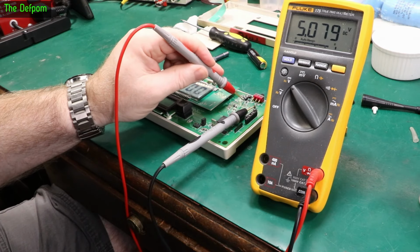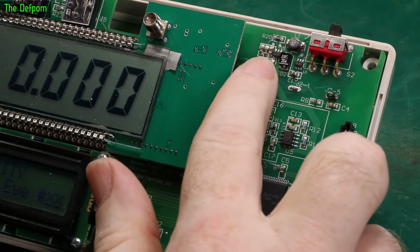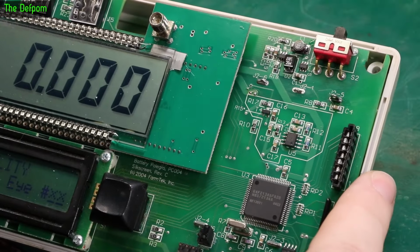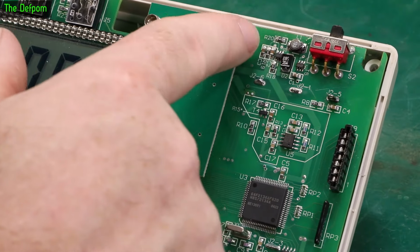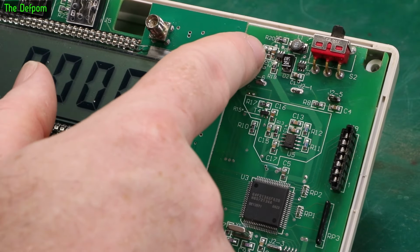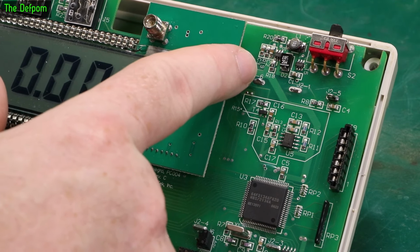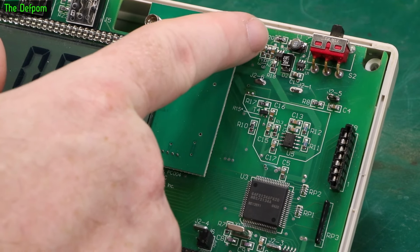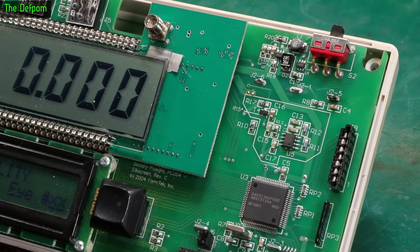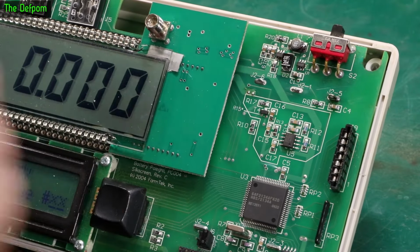Yep, look at that. So this regulator circuit up here, I should actually explain a bit more about what this chip actually is. It's a 1.2 megahertz, 600 milliamp boost converter, and that's what it's basically doing. Like I said, R19 and R20 are the feedback. R19 will be the main rail output from the actual switcher, feeding back through R19, divided down by R20, and back into the chip's feedback pin, so it knows what voltage it's generating. So if you change that ratio in those resistors, you change the output voltage.